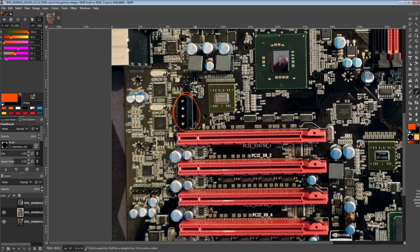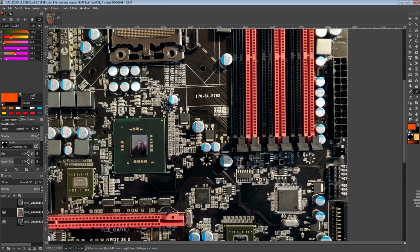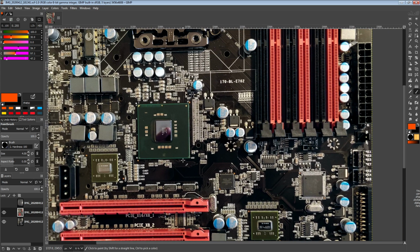We've also got a Molex power connector, which is just for providing extra power to the PCIe slots, because 24 pins are not designed for much more than like 200 watts of power on the plus 12 volts. Well, it depends on which variant of the 24 pin you have, but even with the high current variant, it's just generally better if you're not trying to power 4 GPUs through a single 24 pin. That doesn't tend to go well.